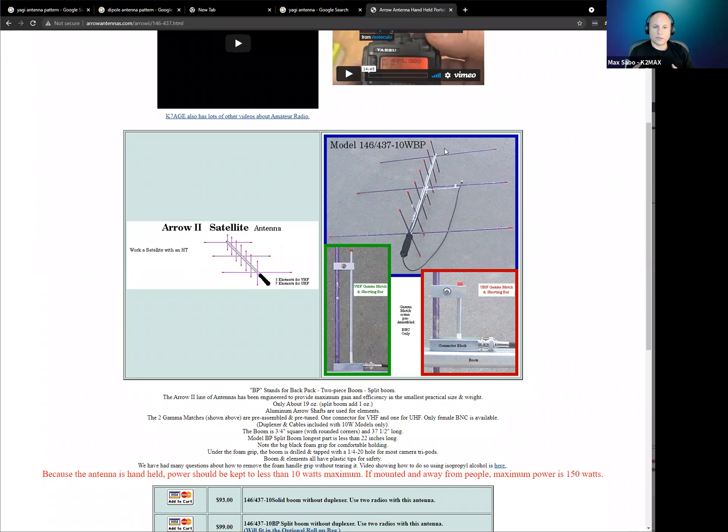And the great thing is, because they're separated by 90 degrees, you don't have to worry about interference from one to another. Now, yes, it is possible to build both Yagi antennas in the same plane, but you have to tune them and make sure that they aren't interfering with each other. So if anybody's interested in amateur radio satellite work, this is one of the more popular antennas.